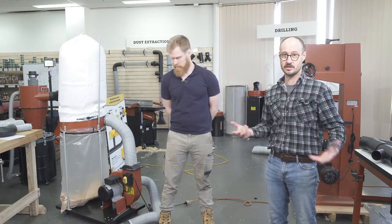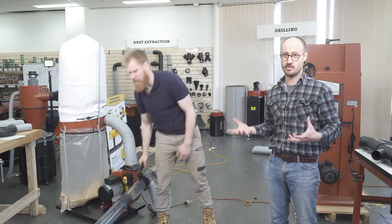What's the turbine called? Impeller. That's right. So it is a metallic impeller. You don't want the potential for nuts and bolts getting stuck between the impeller blades. So make sure that your dust is dust and not washers and bolts. Some extractors will be designed for that sort of material. If you've got a cyclone in front of the impeller, then it's going to go bangity, bangity, bang as it goes through the cyclone, but it won't hurt the impeller.